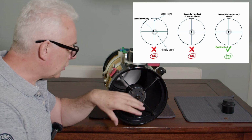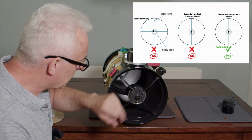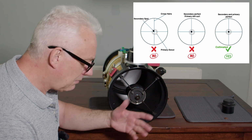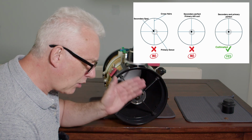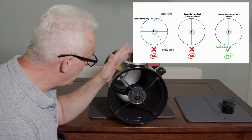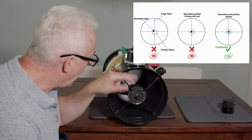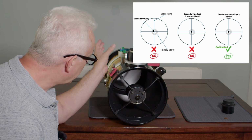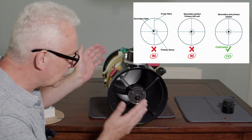And again, I want to stress this to you, you cannot collimate this in the dark under the night sky with a star, because if you make your donut concentric, you've decollimated the scope. You need to point the telescope now, you could use something like a net curtain, something that will give you a nice white diffuse light, strong enough that you can see all the mirrors and the dot and the donut inside the telescope, and then slowly but surely make these minor adjustments to first the secondary. Make sure the cross is lined up with the dot on the secondary, then finally make sure by adjusting the primary that the donut is lining up with the secondary, and you'll have to do a very tiny iterative process between the two of them to collimate.